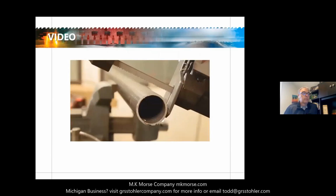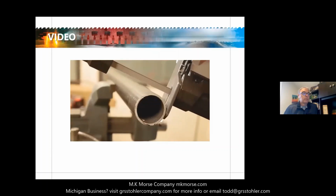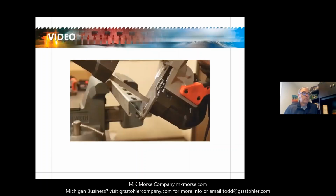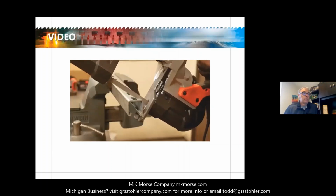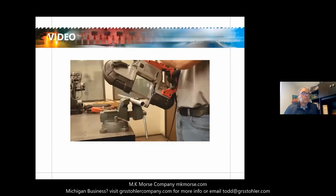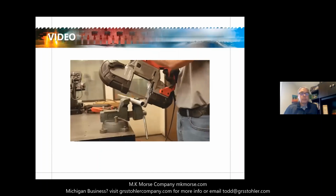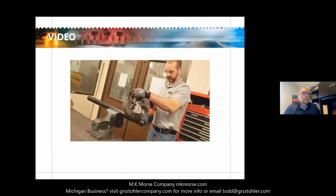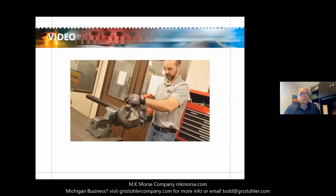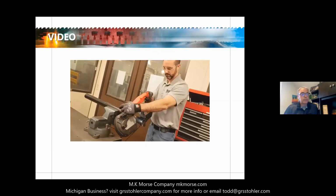Tip 1. Always enter the material with the blade running. Tip 2. Enter the material at the correct angle to minimize the cross-section being cut. Tip 3. Rest the shoe or backup plate firmly against the material while cutting it. Tip 4. When cutting tough materials, rock the blade to change the angle while cutting to reduce friction and be more efficient.